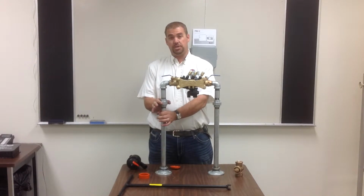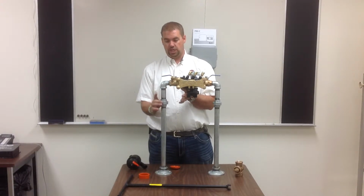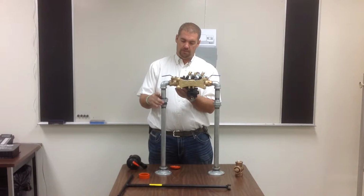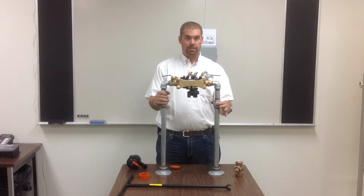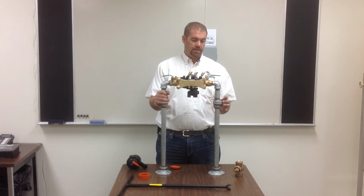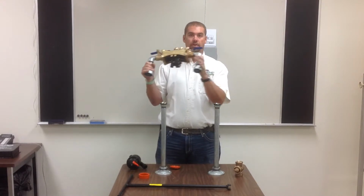And then this union, you're going to take your other pipe wrench, and you're going to start to loosen this union right here. Okay, you'll get this union loosened all the way. Then you'll come over to this other union and do the same thing. You will loosen it. So the way I'm twisting this is I am actually twisting this counterclockwise. I will twist that. Now once they're loose, it will come all the way off.